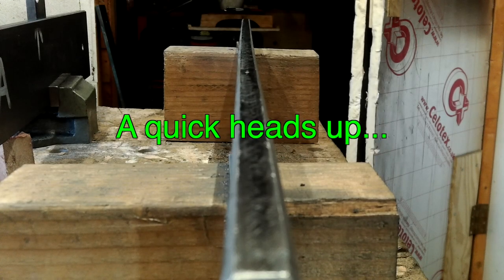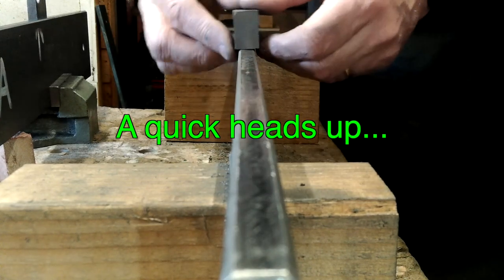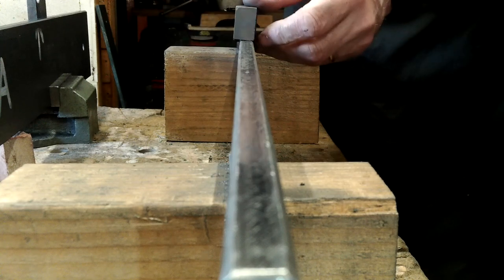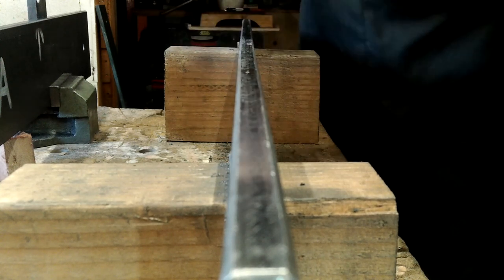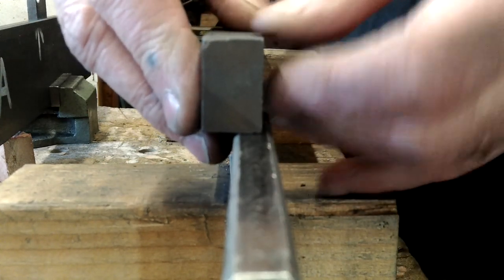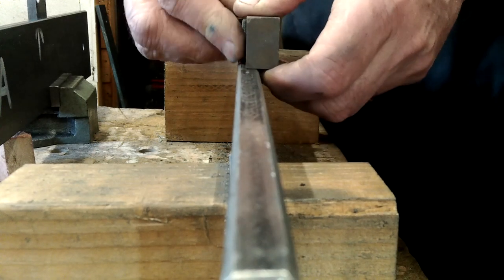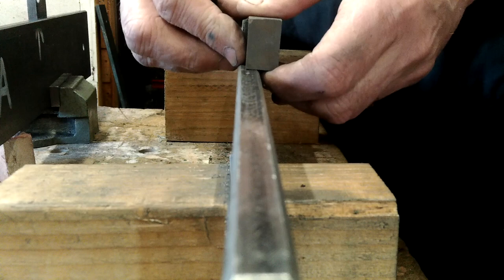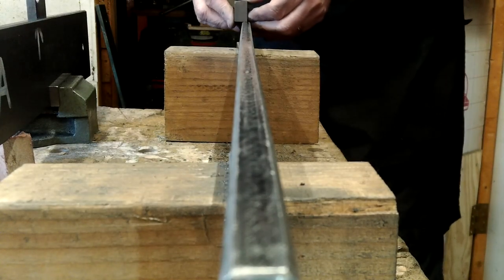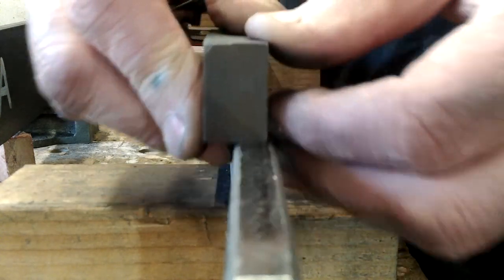Just a quick heads up: after each scraping, especially during the latter part of the process, it's necessary to clean off the burrs generated by the scraping. Because I'm scraping a narrow track it's difficult to keep the stones flat to the top face while pushing along the entire length of the workpiece. I found that holding the stone on top had a tendency to roll over the top, polishing the edges and not removing burrs from the central section. However, if I hold the stone to one side and press on top of the stone over the centre of the workpiece, the stone never rocked. And when both sides were deburred, the central section began to flatten out more readily.